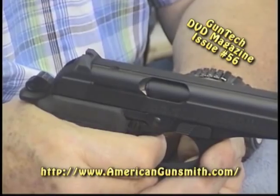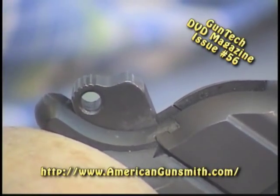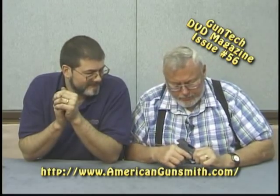The hammer and sear relationship is positive and correct — it feels good. You can see the hammer cam back slightly, which means the hammer-sear relationship is positive. The ramp jump in this gun is good.